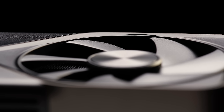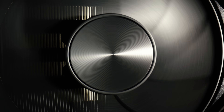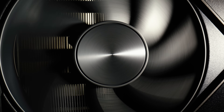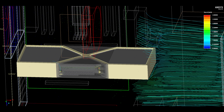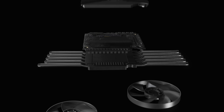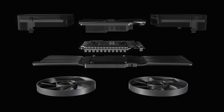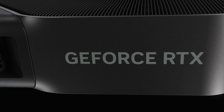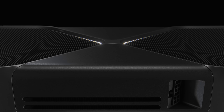When we think about an axial fan, the velocity of the air coming off the fan is not the same at the hub as it is at the outer diameter of the fan blade. Although the angular velocity is the same, the tangential velocity is different and increases with radius — your blade is traveling at its maximum velocity at the outer diameter. The fans take cold air in from your chassis, blow through the fin stack, and exhaust out over the GPU. It's really interesting to think about the overall thermal design as part of the product — no longer is it just a PCB with a heat sink on top. It's a fully integrated thermal, mechanical, and electrical solution, and the cooling solution is the entire graphics card.